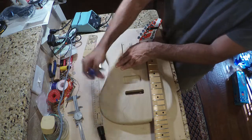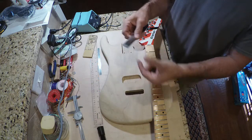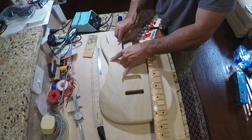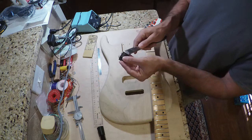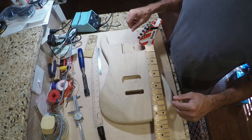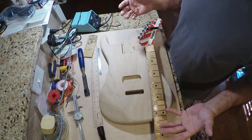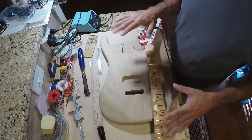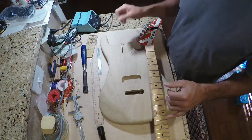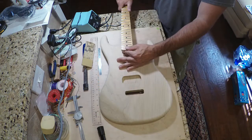We'll use some sandpaper and I've also got a very sharp chisel here - sharpened to 1200 grit sandpaper, you could definitely shave with this. You can just work along there to take out any extra material. At first we had to remove almost a 32nd of wood to get the neck to even go in, and a lot of that was done with the chisel, very carefully cutting and then cleaning up with the sandpaper. So anyway, what we're going to do is determine how it's all lining up. We put the neck back in, get it seated firmly, and now we're going to figure out where the neck's center line is in relation to the body.